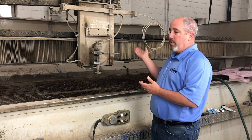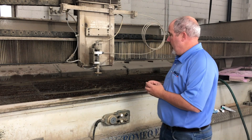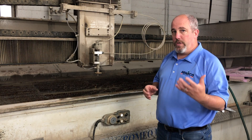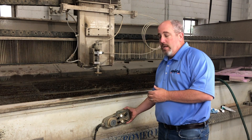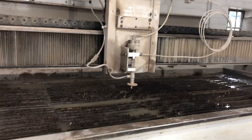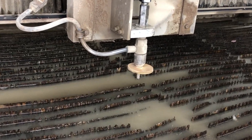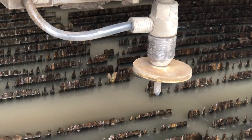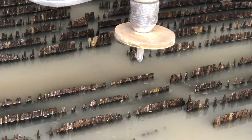What we're going to want to do is turn the pump off while the cutting head is on. In this case, we've already got pressure built up in the lines. This particular customer has the bleed-down plugged, which we don't recommend, but that's the customer site. We're going to grab the controls and turn the head on — and you're going to see high pressure right away.